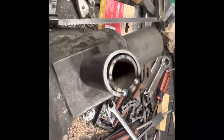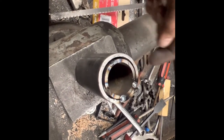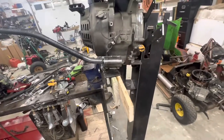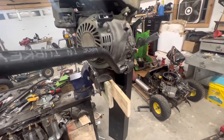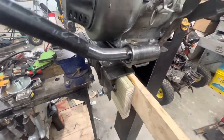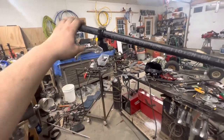It's tack welded in place. Basically right where this top tack weld is, I'm going to put a piece of angle iron across it, mark my center line, put two dents about a half inch from each side — we need five-sixteenths bolts so when the bolt presses down it'll be right in between those two points. I forgot to film the bending of the handle, but basically I marked a line, drilled a hole, tacked that piece of pipe in, drilled a hole through it, ground the welds out, pushed the pipe out, cleaned the welds up, bent a handle, slid it, and tacked it. I then went back and drilled through that pipe so the bolts will not only hold it to this piece of steel but also through the handle itself — so even if the welds break for some reason, the handle's not going to come out.